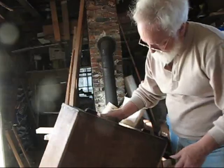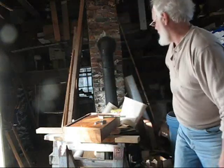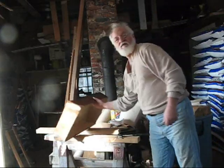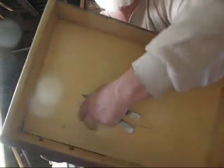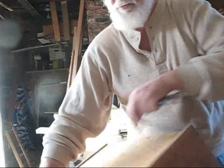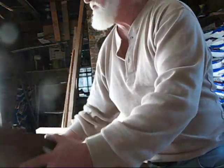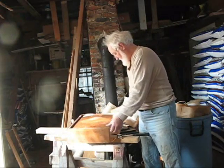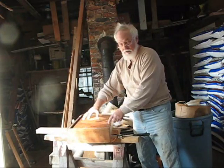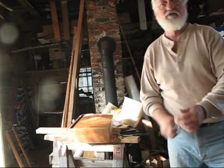This is worth talking about too. These drawers — like this one — this drawer had pulled out of the little notch. There's a notch right in here and the bottom of this drawer goes into that notch. What I did was I took the paper out, drove it back into that notch, got that lined up, and then I put a nail right in this part to hold the whole thing good and sturdy. This is a really cheap, simple, easy fix — doesn't cost you any money, doesn't require any major woodwork — and it changes this from being a drawer with the bottom about to fall out and the whole thing being wobbly, to a good firm drawer. Just thought I'd share that with you.